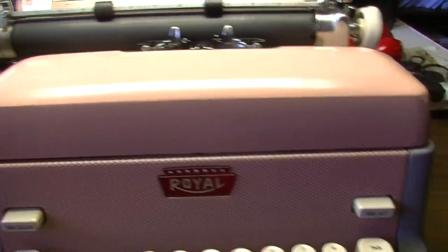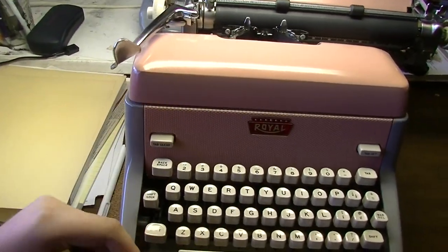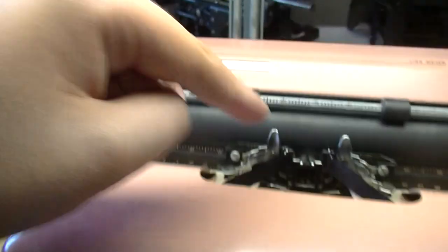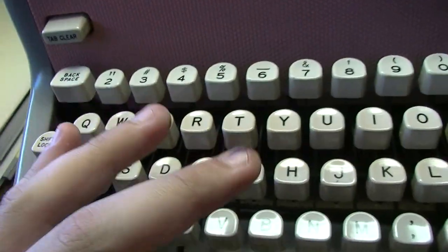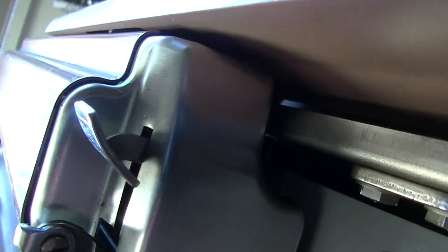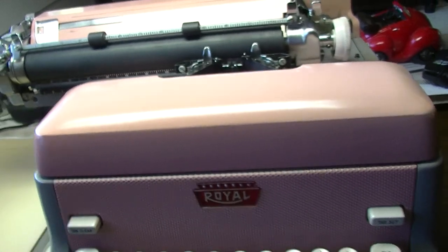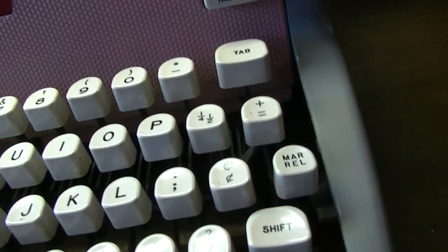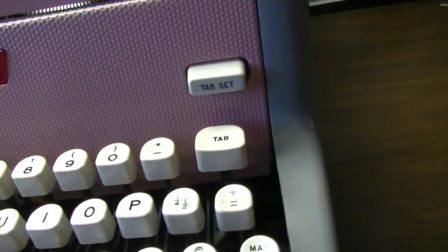This machine is on my desk and is my primary machine to use right now. I noticed that the tabulator was sluggish in returning, which would cause a jam in the advance system — you would hit the tabulator and couldn't continue typing because the tab setting stayed engaged with the button staying down. This turned out to be just one screw tightened too much behind there. There's a screw that adjusts the tightness of the tabulator, and by unscrewing it and oiling it a bit, it works a charm now and doesn't stick down anymore.